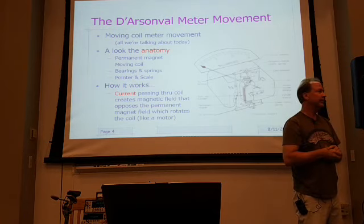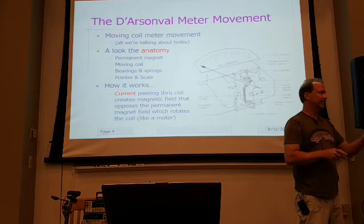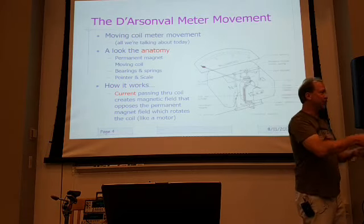That's why, when I was working on a radio a while ago, it gave a reading on the grid. It said 0 volts. Wait a minute. But then you read the diagram, from 1935, and they're using a 1,000 ohm per volt meter. You measure that with a VTVM and you get the right grid voltage. So they're not giving you the actual operating voltage, they're giving you what you should be looking for, what you'd see with the equipment that you used in the day.